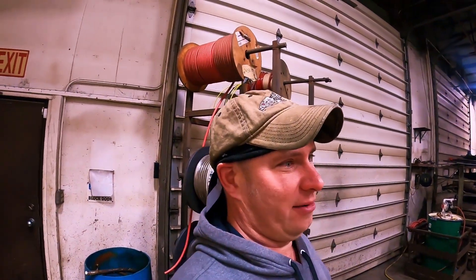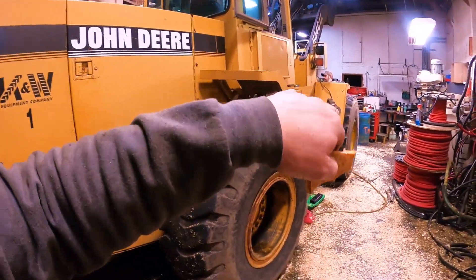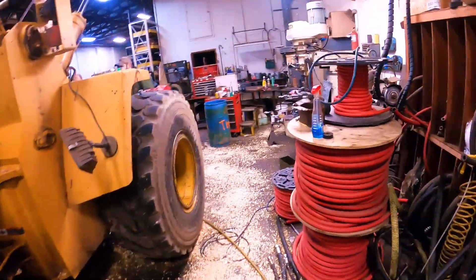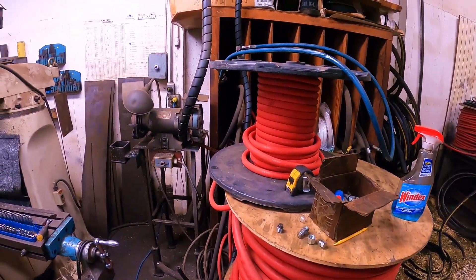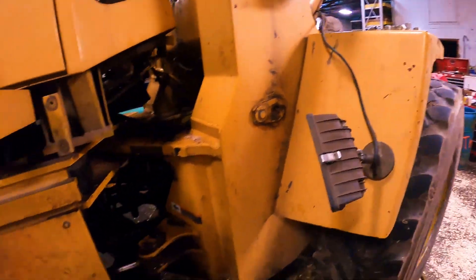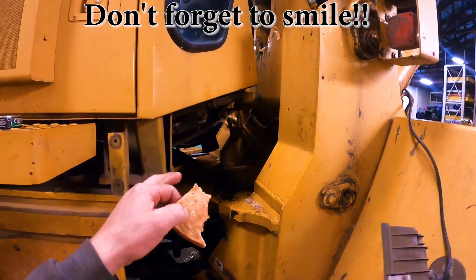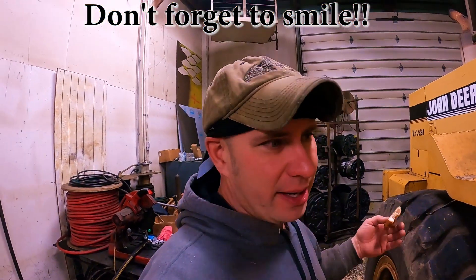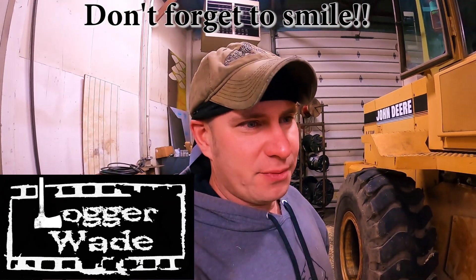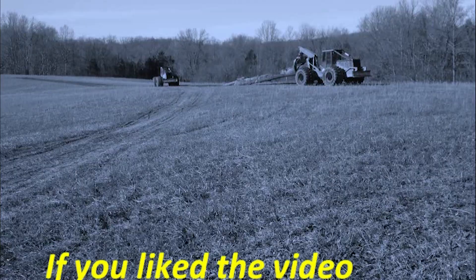I came in and Matt and Mikey started working on the hose. I thought, well, I'll check this — I'll do a bypass check. What I did on the bypass check: I made this fitting for my hydraulic testing kit. I put that on a hose — this goes to the back rear end and the other side goes to the front rear end, and that's the brake hose. I pressured it up with air, then went to the rear end and listened to each front and back for air bypasses and bubbles. Derek's got it tighter than Fort Knox — it ain't leaking. I told dad just run it, because it was overfull. I asked Derek when he came in yesterday — I said was it full? He said oh, it was full full. So it just expanded and he's making room in there.